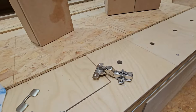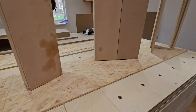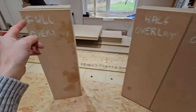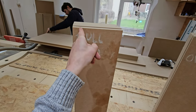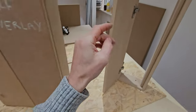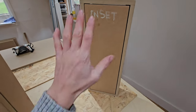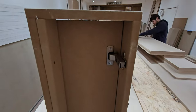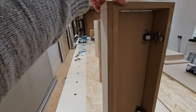Let's move on to the last one — we've got the inset with the biggest kick. It looks like it's pushed out about 18mm. What that does is allow you to have that door completely within the frame. It's pulling that door from 18mm overhang to zero overhang — in line with the inside of the frame. The edge of the door moves over 18mm, which allows us to house that door inside of a frame. So if you want that inset look, where you want to see the framework and the door sitting within it, then inset is what you want. You can see how that bend in the hinge allows the door to sit in by 18mm.